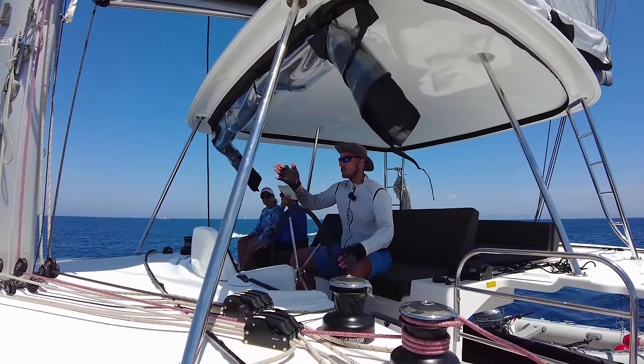So we have to change the course a little bit down because our island is a little bit lower. So the wind is from here, right? If we change the direction downwind, you have to release both the sails, which means we're gonna release this Genoa sheet so the sail opens more. And we've done the same on the main. We have used this traveler behind. It's actually operated just by these buttons. So let's look, if I press, you see it moves. This is the winch that's controlling. So also we have to open the main more. The more downwind you go, the more you have to open the sails.